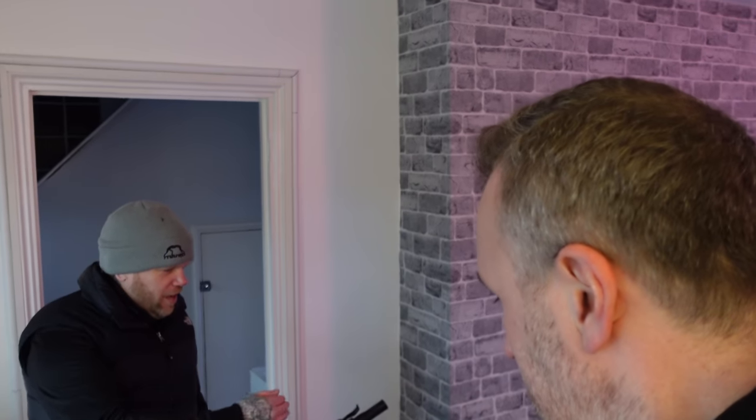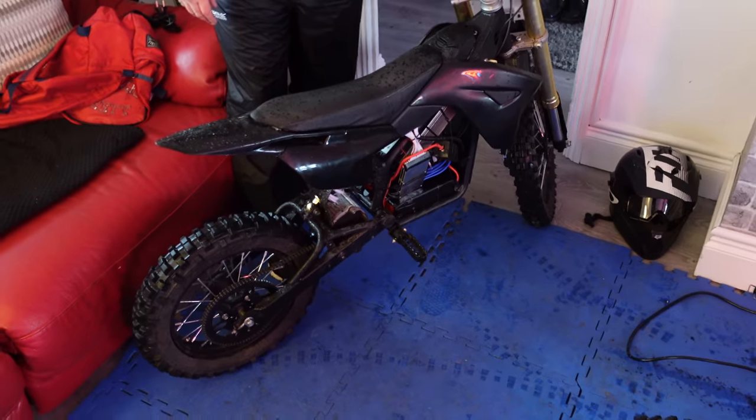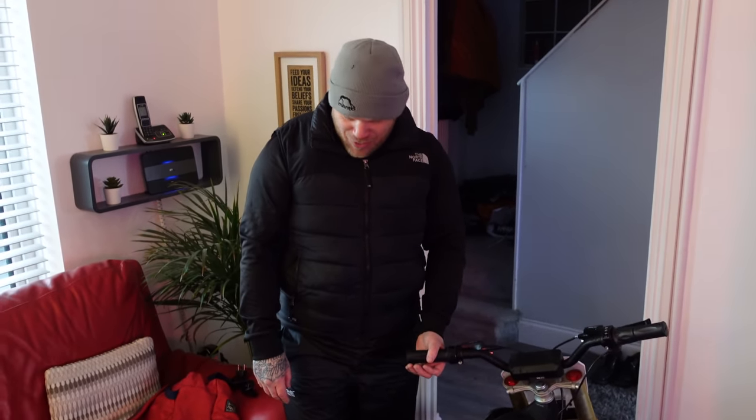It's a bit twitchy for trail riding. Both bikes side by side — they kind of look like they do the same, but they feel a lot different. It could be the motor, or the gear ratio. I'm wondering — this has got a slightly longer swingarm, and I wonder if that's what's making the difference. If it's shorter, it'd be a little lighter on the front end. Yours feels like it's flipping up all the time. This feels a bit tamer and doesn't feel as fast. We might have just got lost in the power — we've heard it so many times on test runs. We need to come back fresh.